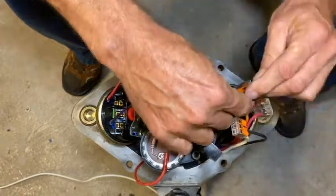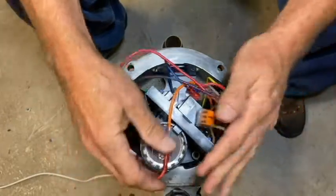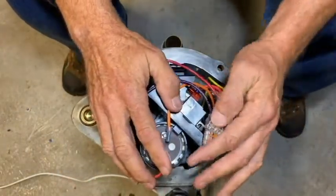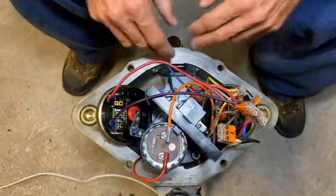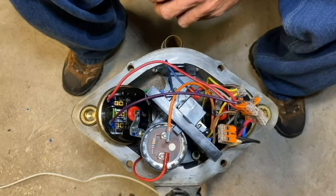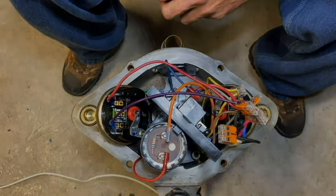At this point I would recommend that you go ahead and plug it into your test panel and bump it — make sure that it runs normally and everything's connected properly. Then go ahead and replace your seal, put your cover back on, and pressure test the compartment. That concludes retrofitting a 2000 series pump to a new MCB 240-volt, 60-hertz motor controller board assembly.